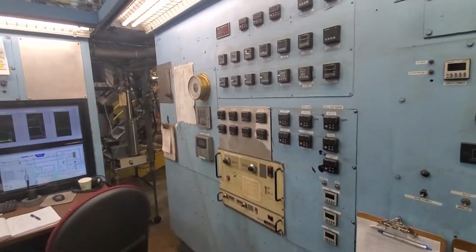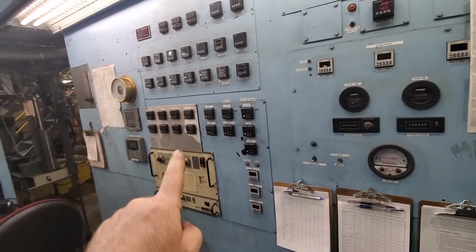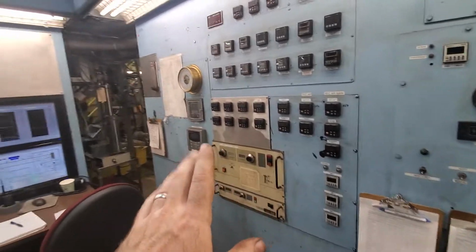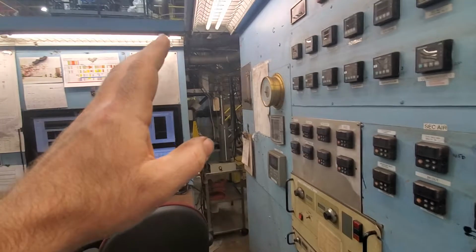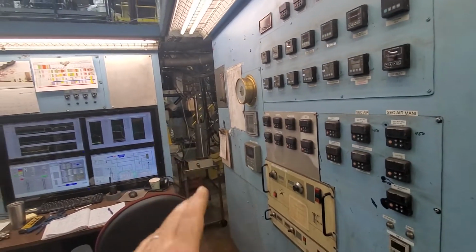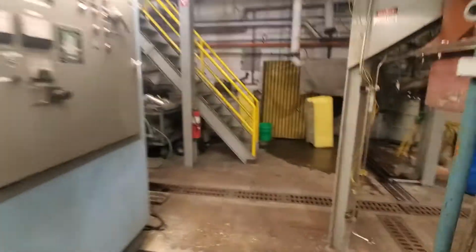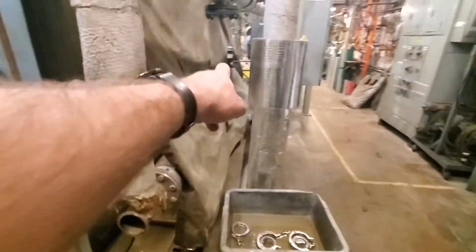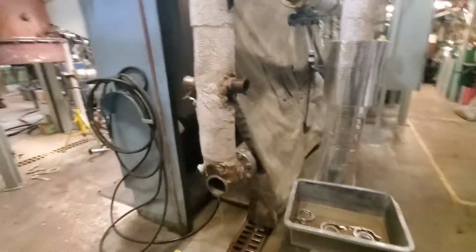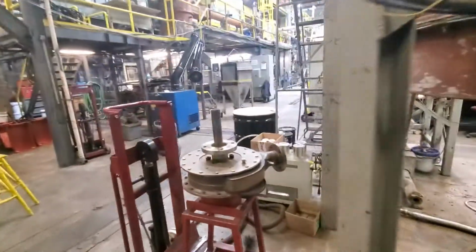And then I always make sure I tell the operator, you do not touch that ESP until that is de-energized and tagged. So that's how we do that. So he's washing down the ESP back there. He'll have drained it, gotten the ash out, and then they wash that. And they wash the inlet pipe. They get quite a bit of material out of there. That's really all we can do on the turnaround. The bulk of the work is on the wet scrubber.